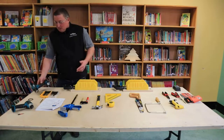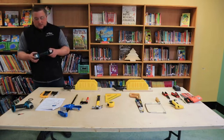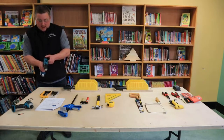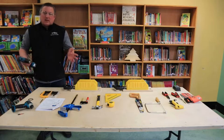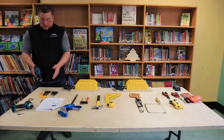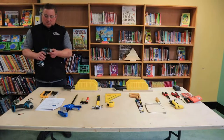With this we're going to start with the cordless tools. We've got a cordless drill here and it has a speed limit on the side — one and two. One is a slower speed and two is a faster speed. I would always suggest, depending on the size of the drill bit you're using and the speed you need, to just keep it on number two, because a lot of the drill bits you'll be using are smaller and you'll need faster speed to make them work.